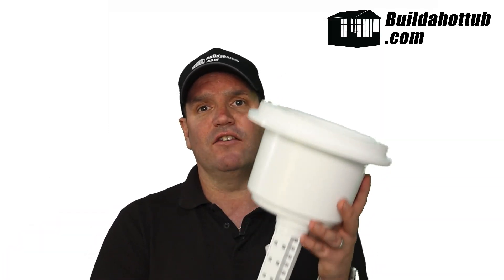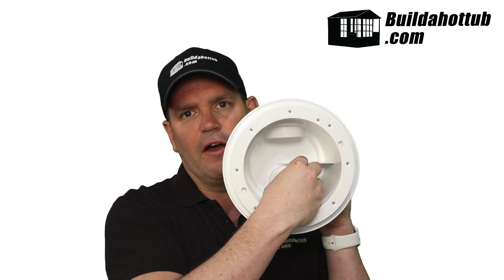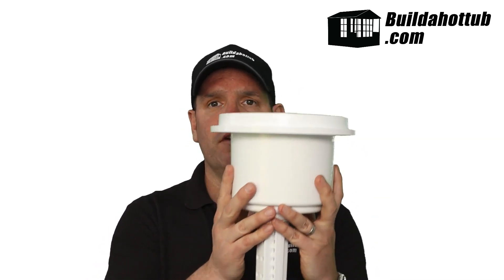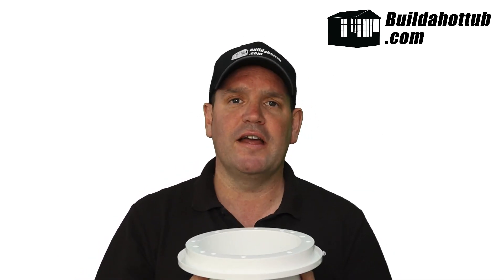How it works is the water enters through the collector as the pressure builds up. Inside the lower drain, the valve can open — it lets water into the drain, and if there's more than that, it does enter your pool. But most importantly, it protects that pool or hot tub from water pressure, from damage, and from being lifted out of the ground if you have a high water table. Fitting one is pretty straightforward: you put it into the ground, pour your concrete base around it, and the hydrostatic valve simply screws into place in the bottom drain.